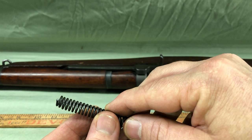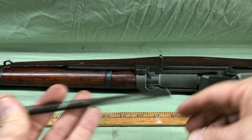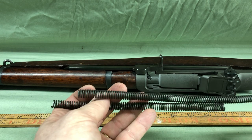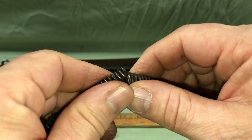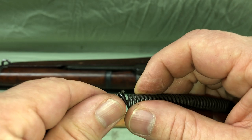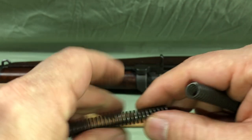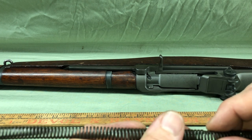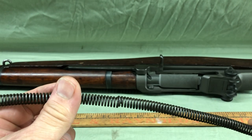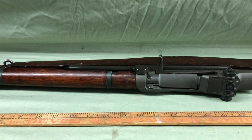This is an aftermarket — notice the end. It's actually broken. This is an example of a broken op rod spring; it does happen. Right here you can see the actual breaks. It's not a machine cut — see how it fits perfect? And it's also had the GI end on it. So you have to be cognizant: just because your spring is sticking out, it could be like this on the inside. It can thread into itself. You just have to be careful and inspect your springs, because all this comes into play when you're inspecting your rifle for the op rod tilt method check.